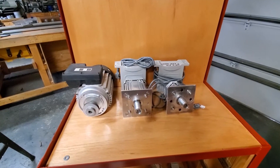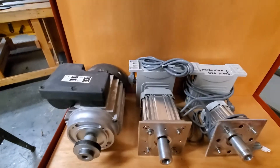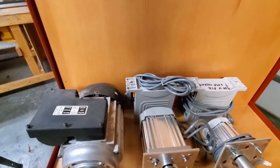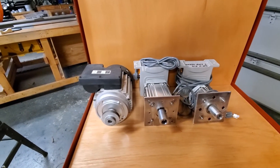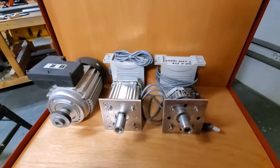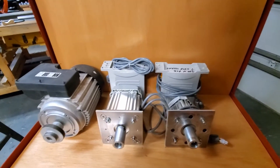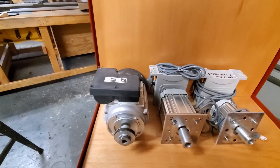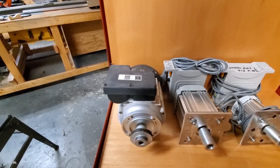These are the motors we're going to use. The one on the left, the largest one, is the original motor. It has a fixed speed of 1,700 RPMs and is one horsepower. The next one is two horsepower, and the one farthest to the right is 1.2 horsepower. Servo motors can produce considerably more power for their size. At 1,700 RPMs, the original motor was a one-to-one ratio — that means 1,700 feet per minute blade speed.